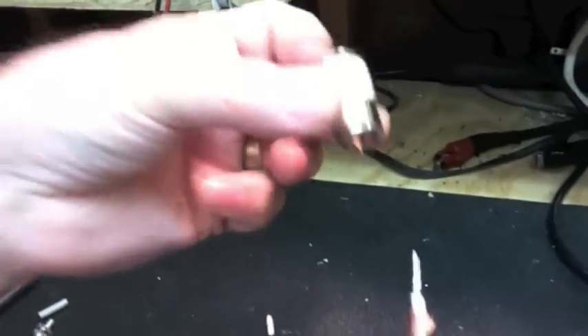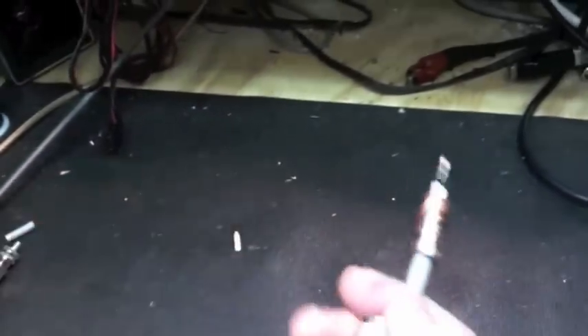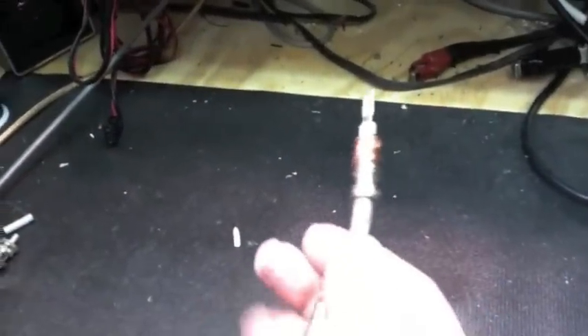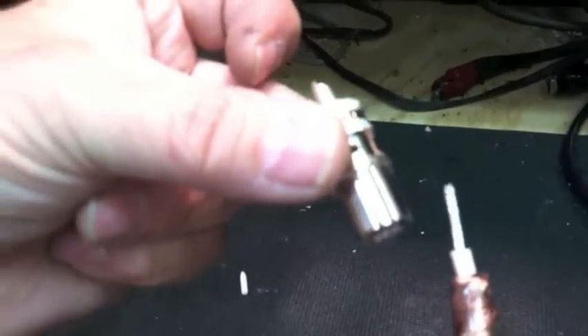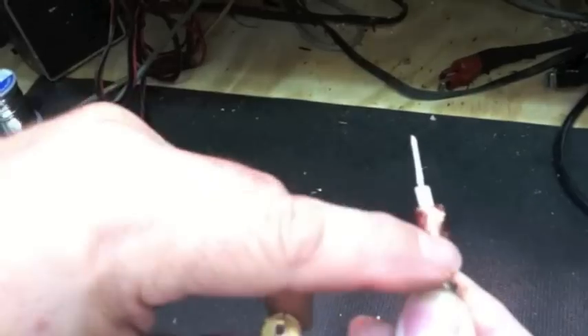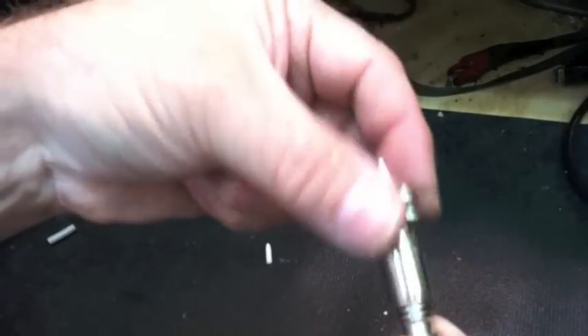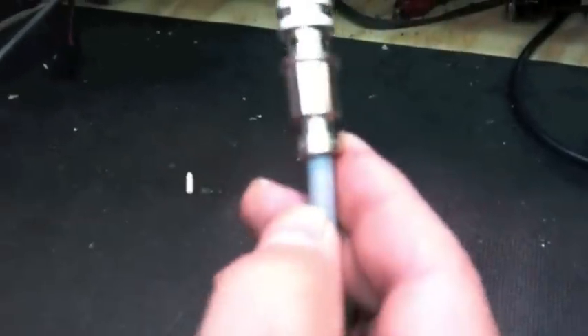This collar will go on normally first, and then this piece of your PL-259 goes on next. Hold your adapter in place and screw on the PL-259. Do not let it move forward or backwards either way. Hold this adapter in place.